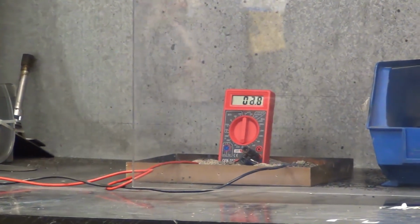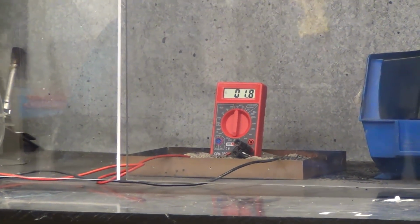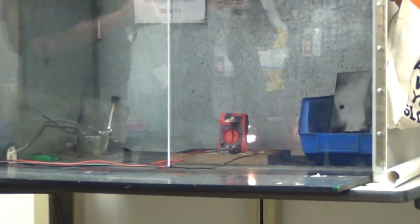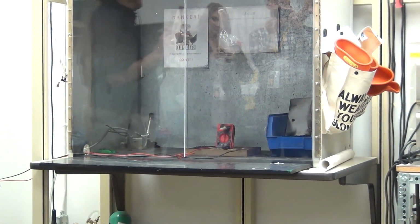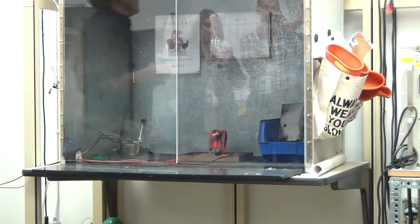So in this case I've selected an ohm circuit, okay? That's what happens if the meter is not designed correctly. Although it worked just fine for measuring the voltage, if you happen to have it in the wrong function when you did it, it creates a very big hazard.